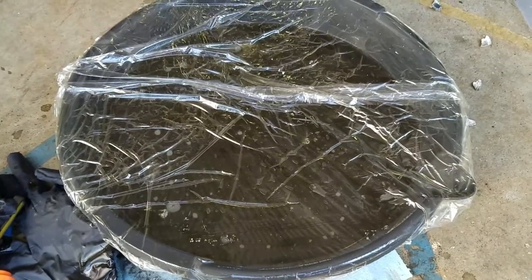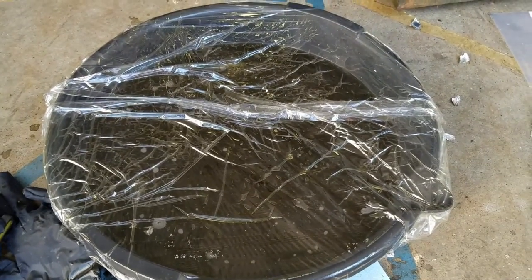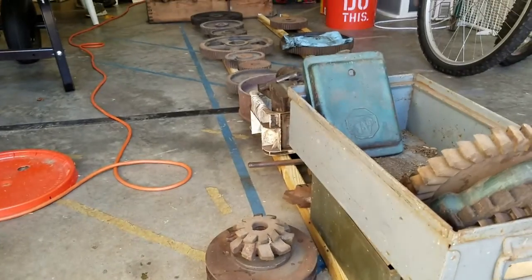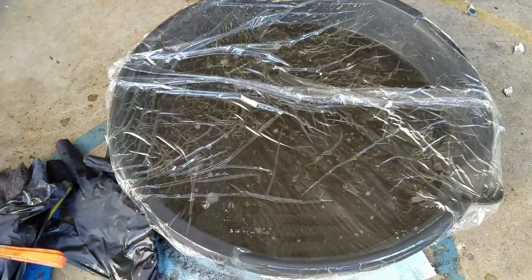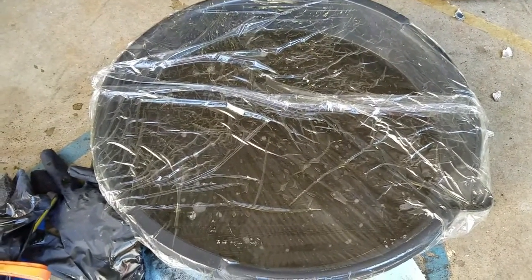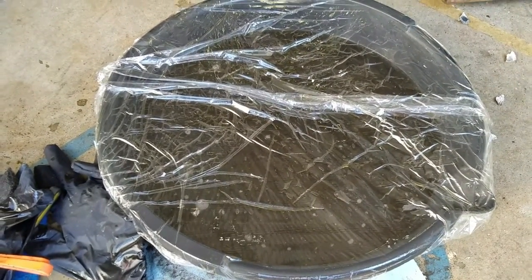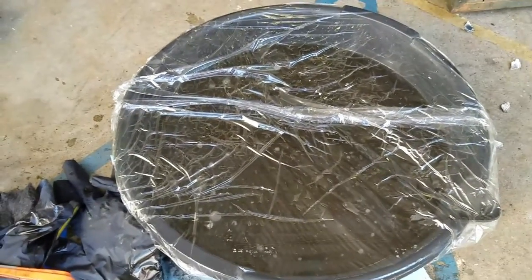Here's the setup — it's pretty simple. I've got an oil pan that I've half filled with evaporust, which is big enough to get most of the gears in. Some of them are too large, so I'll have to come up with something else for that, but most of the gears will fit. I've just covered it with saran wrap to keep it from evaporating off. So far it's dead simple, dead easy, and working great.